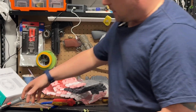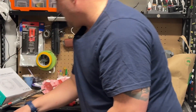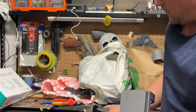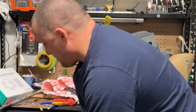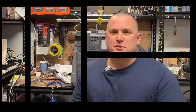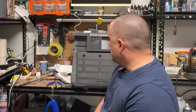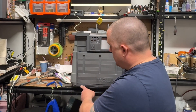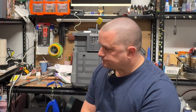Got our first tank tread together — needs to be painted. In the first part of the WALL-E build series, this was the print for the main body. I think it weighs about three, maybe four kilos. Not perfect prints — I did have some warping here on the bottom, but we can easily fill that in. Other than that, the body section is almost together. I just need to get the right size bolts, as I've got a few that are different sizes.